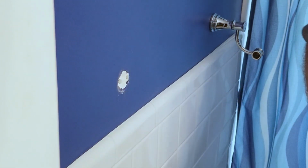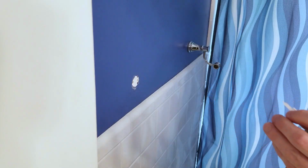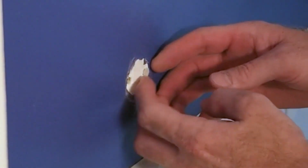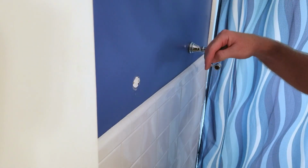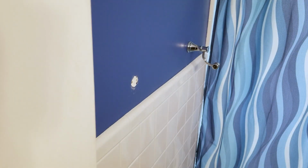Looking to see what they did here, they just used some drywall screws and some plastic wall anchors that are pretty much shot. So we are going to use a little bit better wall anchors than what are in there. I'm going to use hollow wall anchors. I'll put the link in the description if you want to check them out. It's got some looseness on the other side also, so we might as well go ahead and take care of that at the same time.